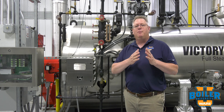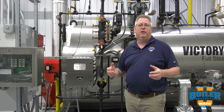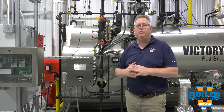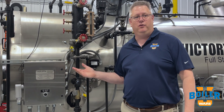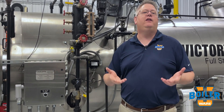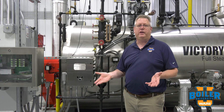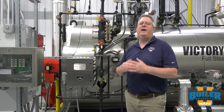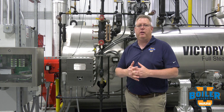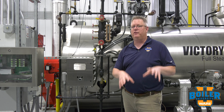If you have a boiler house with multiple boilers that are relatively small — not massive water tube boilers — it's best practice to trip the boiler on the low water cutoff when you do the blow down. The reason is that we're verifying both the float operation and the electrical circuit operation, because the float may fall and make an alarm, but unless we actually allow it to trip the boiler, we don't genuinely know that that aspect will function properly.